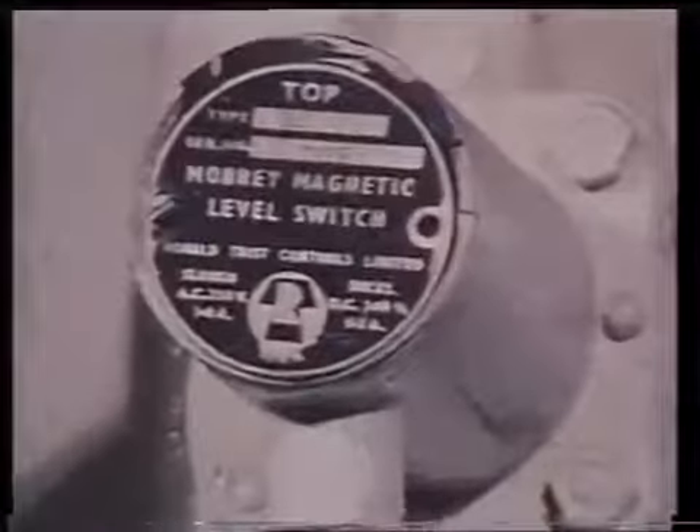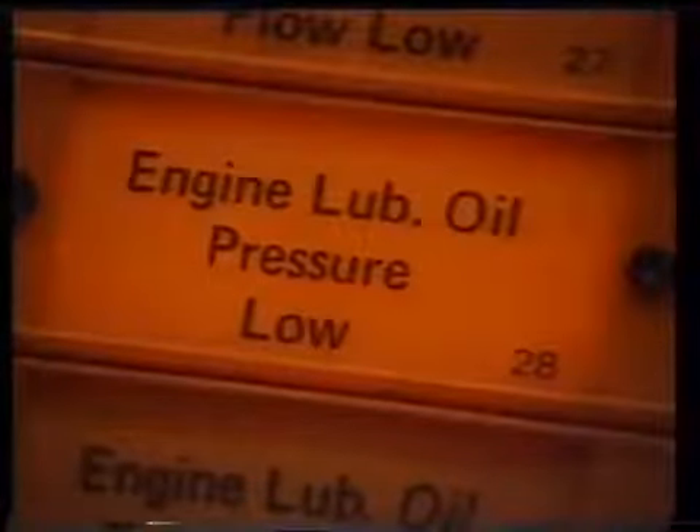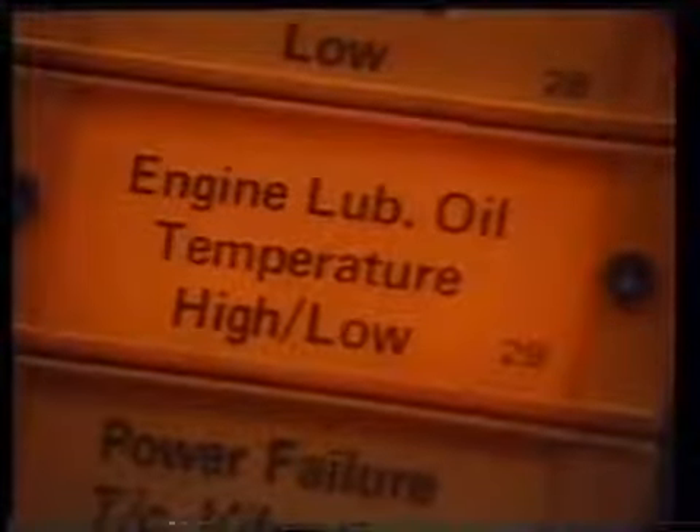Now we've come to UMS operation. UMS stands for unattended machinery space. There are several alarm circuits associated with the main engine and the auxiliary machines, their lubrication and cooling systems. Their operation is dependent on a series of pressure switches, flow switches, level switches or temperature switches which must function correctly for the ship to remain in classification. These are usually set and tested at the periodic engine survey and should only be touched if malfunction occurs. Test the circuitry for open circuit or short circuit and replace any faulty sensor unit or switch. There are also duplicate bilge pump alarms which form part of the UMS monitoring system and must also be checked periodically for correct function by manually overriding the switches.